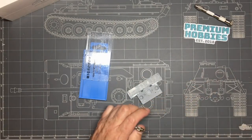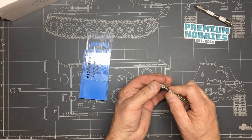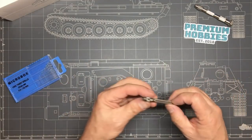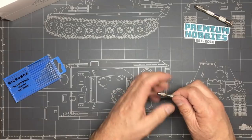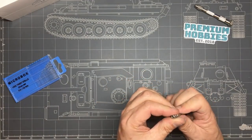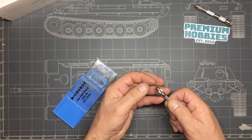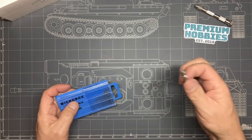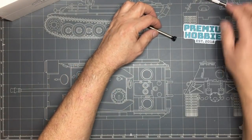So that's another tool for you to look at. But basically what we're looking at today is these David Union products. This pin vice is £9.95 from Premium Hobbies, so with your 10% discount it's going to be £9 — a really good price for what is a quite high-precision little product. It's beautifully made and the collet has a very fine angle giving really good clamping pressure. It says it goes 0.1 to 1mm, but mine will actually take a 1.3mm drill, probably even 1.4mm with a bit of pressure — so that's a pretty good range for such a small tool.